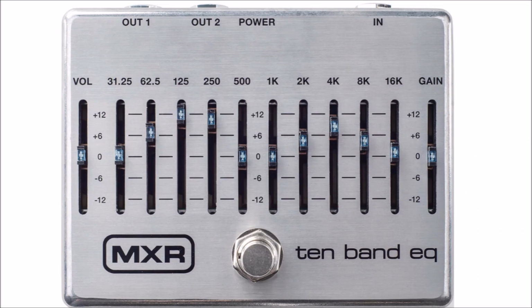Fortunately, MXR realized what people were doing with their pedals, like Kerry King, and eventually they released the M109S and M108S that are supposed to be their updated silent versions. You'll see them in like chrome with blue LEDs, and they're supposed to be much lower noise floor. If you have one of these already, you can actually send them off or even buy parts yourself and modify them with higher quality components to where the noise floor is more comparable to something like this.